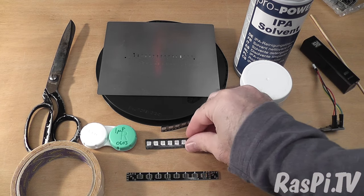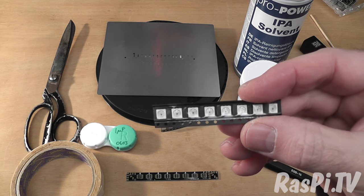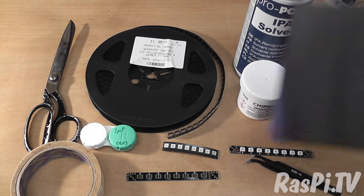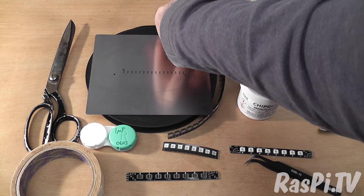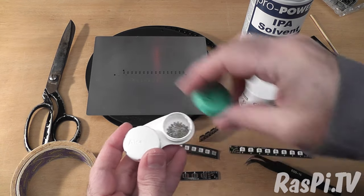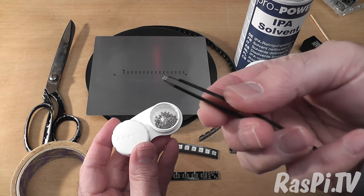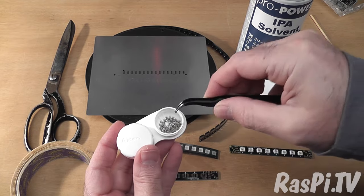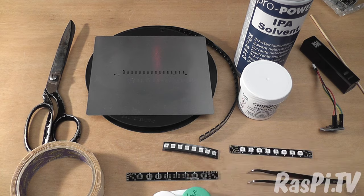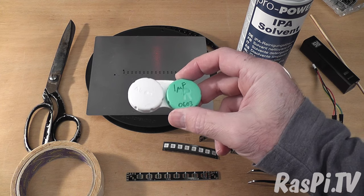We also have components. These are the LEDs — these ones are actually SK9822s and they come on reels. That's a reel of a thousand that I bought for prototyping. We also need some teeny weeny 0603 capacitors. They really are teeny weeny and strain my eyes to use them. I often keep surface mount components in old contact lens cases because they're ideal.